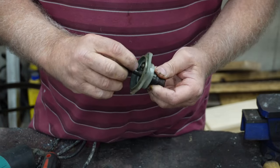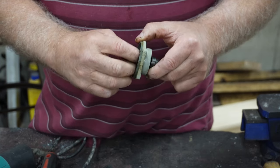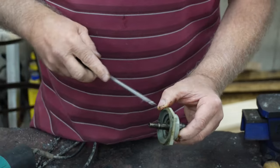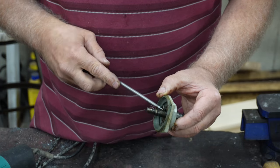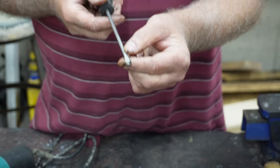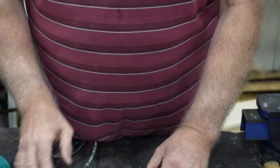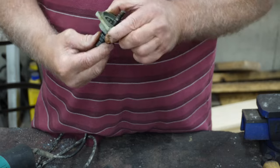There's a little key in here now. I'm going to see if I can't pop that key off of there — it feels loose, so it should come out fairly easy. Yep, came right out — it's on the end of the screwdriver. Right there. Now let's see if this shaft will come out.